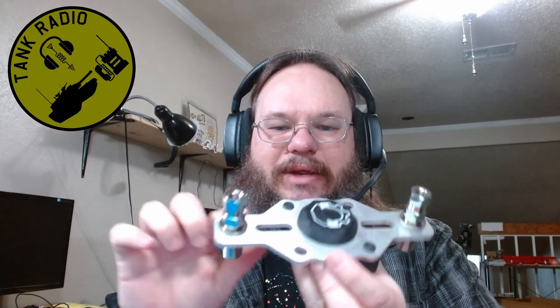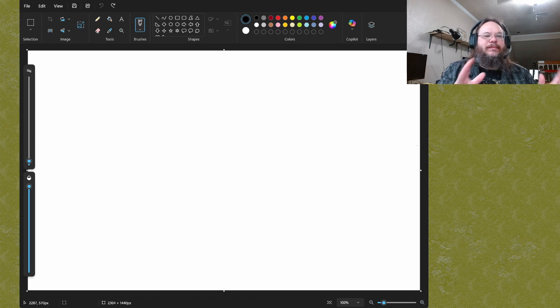I am going to be using the Skyhook Solutions to mount my hamsticks — this is a metal CNC part that you can mount hamsticks to. However, hamsticks are meant to be on cars and they use the car as the grounding point of the system. There's not a lot of grounding space to this, so we're going to have to build a counterpoise for it. Head over to Tio's Ham Nuggets where we did a live stream talking about designing the counterpoise system, and now I'm going to be building it.